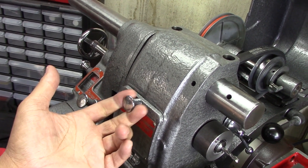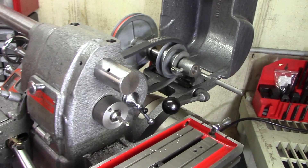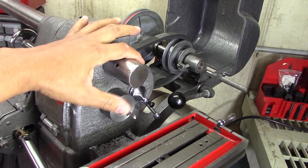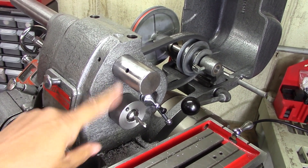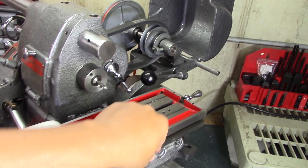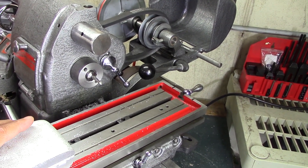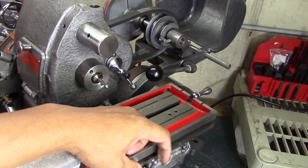I also need to fix the spring so that it stays all the way closed without that little bit of wobble — it's homemade. One of the major things is I don't have an arbor, which is why I'm not using it in the horizontal configuration. But I've got the stock to make one and I intend to make an arbor. The locks on the other axes also all need to be replaced or made new.